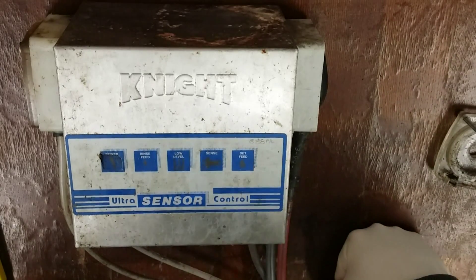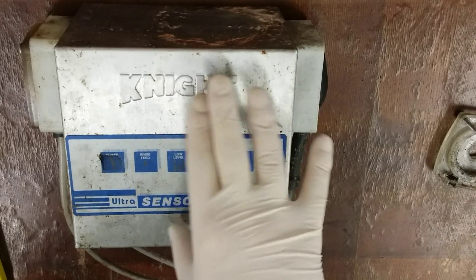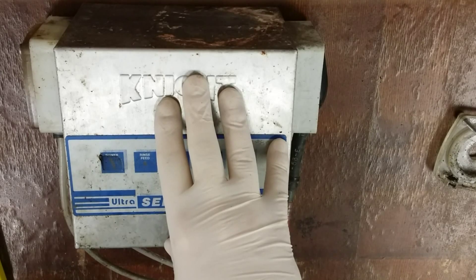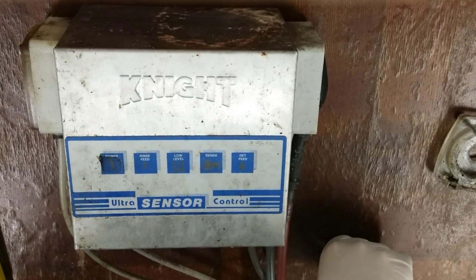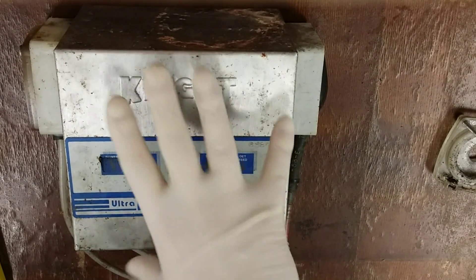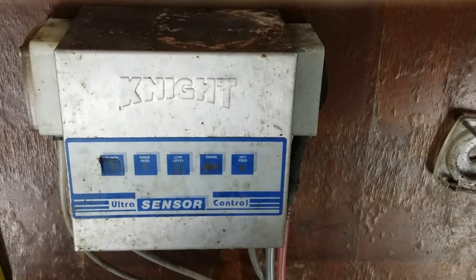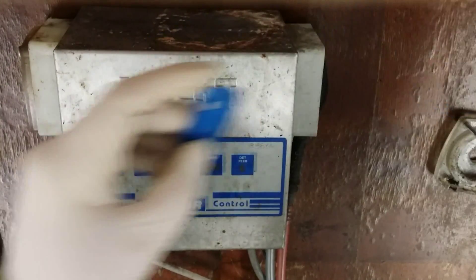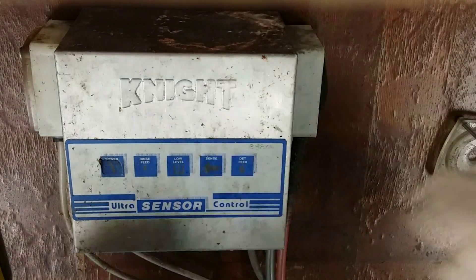If your chemical level is too high or too low, find out from the manufacturer whether you're allowed to open the front casing. You need to be a licensed technician if the voltage is too high — in Australia it's 240 volt, and if it's 240 volt you can't open the casing. But all of these newer units let you open the top casing, or they've got a flip-up case so you can adjust the chemical without fully opening it up. With this unit here you'll need to open it up.